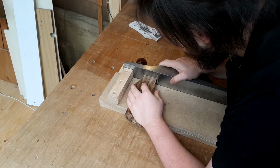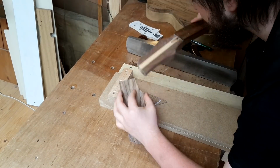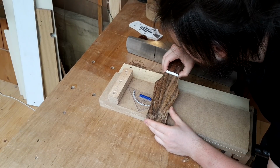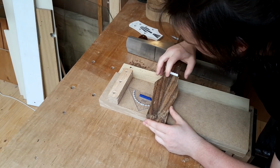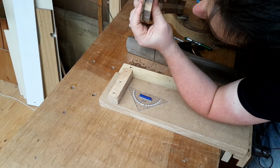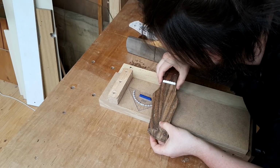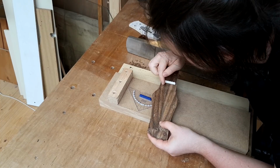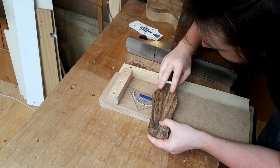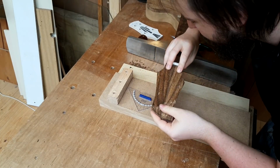Something else. And that in place, and that goes there. See, I push this against it, so it's now holding up. And then when I go to check the center point back here, if they're lining up, that means this angle here is still 90 degrees to the center line, which is what I want. And that is spot on there.